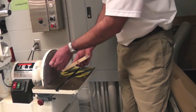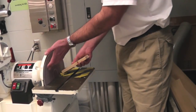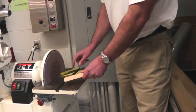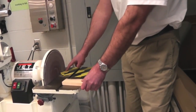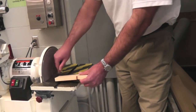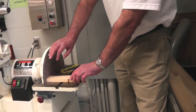That's going to pull this piece of wood up if you're sanding on that side, and a number of people have gotten their front teeth knocked out because the wood kicks up and hits them in the teeth or mouth. This side has yellow and black tape showing you that it is not the correct side to use. The left side that rotates down towards the ground is not marked off with yellow and black tape, which indicates that that's the side we should be using.